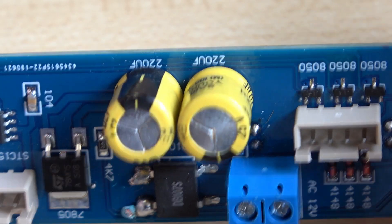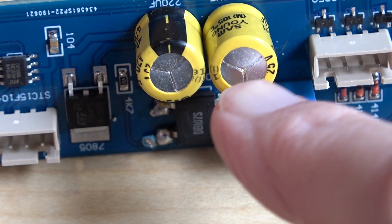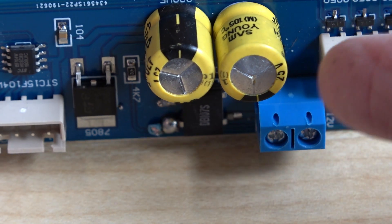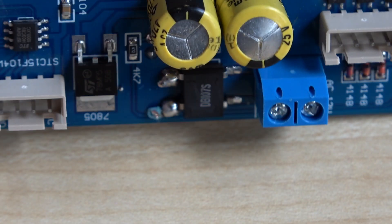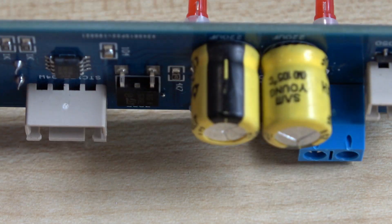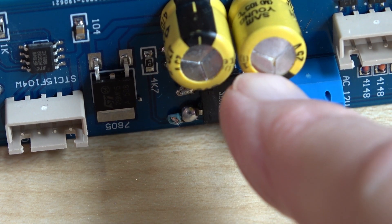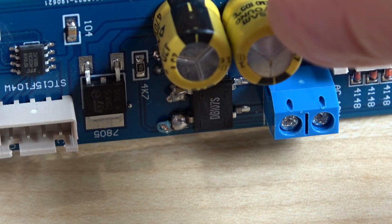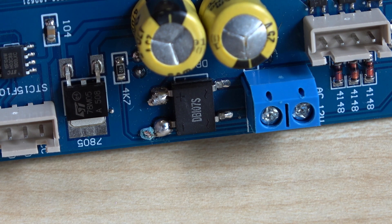The reason I'm telling you about this is that when I've looked back at the other videos I've made, every one of these boards has that capacitor round the wrong way. The likelihood of it exploding is probably quite slim, given the relatively low voltage and the high working voltage rating of the capacitor — but this has been working the wrong way round for over a year and a half and it's only just started to play up. So if you've got one of these, check that the capacitor is around the right way. The negative should be up — the opposite of this one. I'm going to replace this capacitor and it should all spring back to life again.